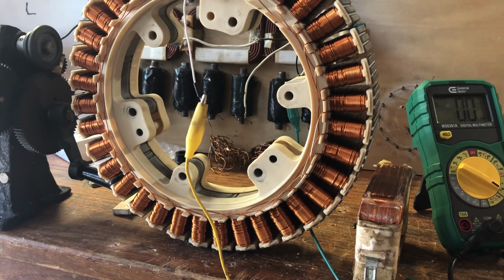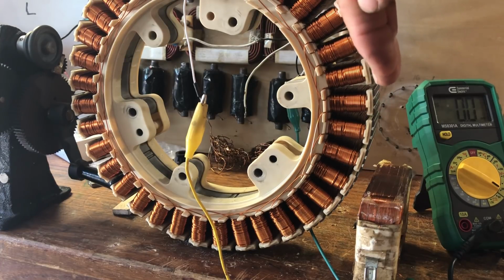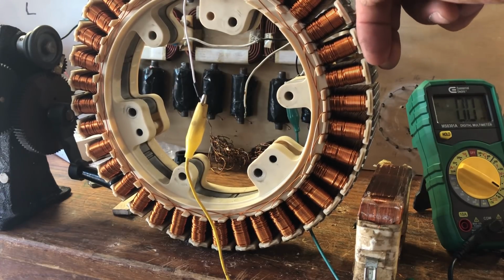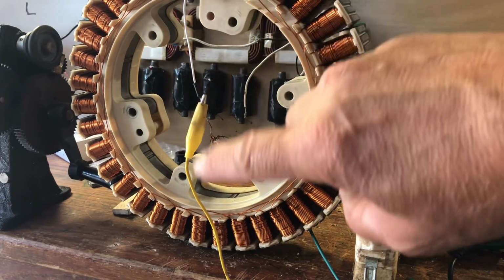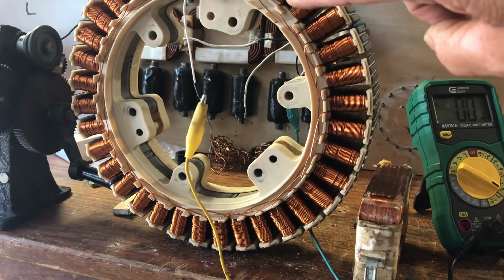So the feedback will turn on and off the next 2 or 3 transistors. So we're creating, like if this was a roller coaster ride, every time it's getting fired up from the transistors in doses of 3. So you got 3 phase here, and it's always having 2 always connected. So 2 are going, then as it goes to the 3rd, we're leaving that one, always dragging behind, and we're firing up. So the idea is to get the half cycle fired up. Once you get the half cycle fired up, the process will repeat through the other half of the cycle, and then it'll start over again.